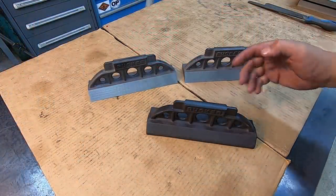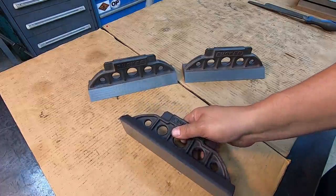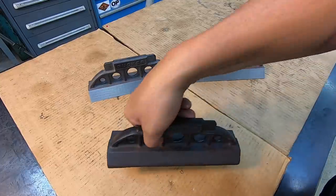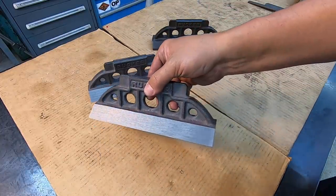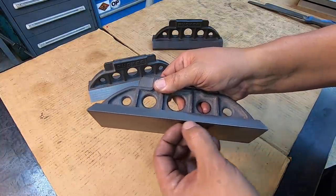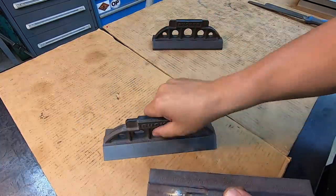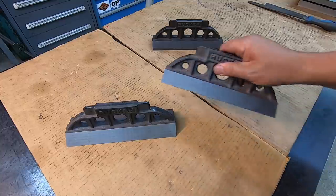We've got our two customer squares finished up. I haven't gone any further with mine because I've decided, since I have both the mill and the shaper set up, to go over to the mill and take a little bit more off, mill the sides, try to get out of that hard area, and then cut the angle just like we showed. But you've already seen me do these so I didn't want to keep taking up screen time. These turned out real nice — I'm really happy with the way they look. We already got them filed — I took it just to the edge of the casting and filed it a little bit to leave just a nice tiny flat right there. Good finish on it. These should make some excellent scraper projects.